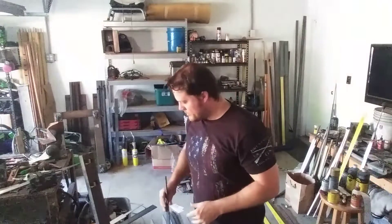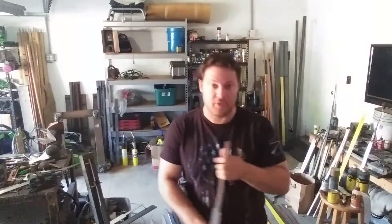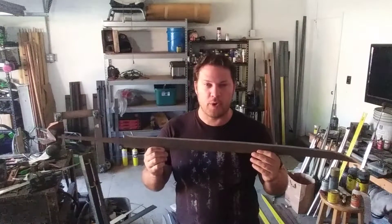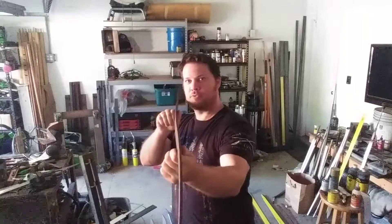When you're doing a bulk heat treatment of a lot of blades, there's no time to do that — you can't do it. So if we don't take any precautions and go right into heat treat and get the blades back, this is what happens. This is an older blade, actually a two-handed messer, and it went in with no fixturing — just right in the quench and temper in the bulk heat treat. As you can see, it warps drastically.